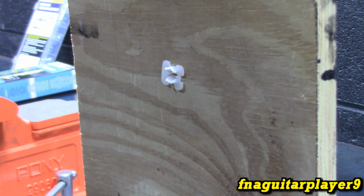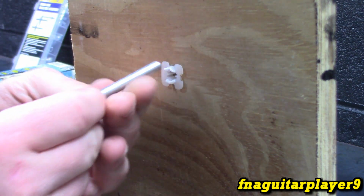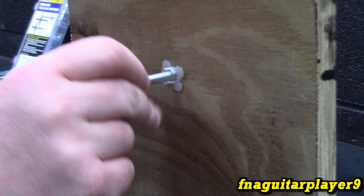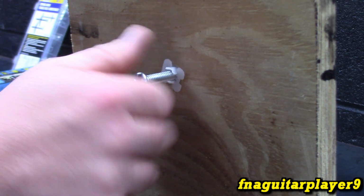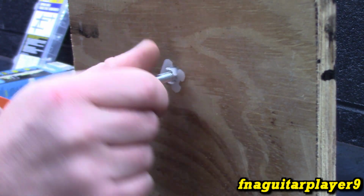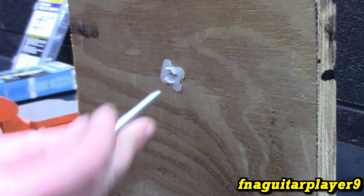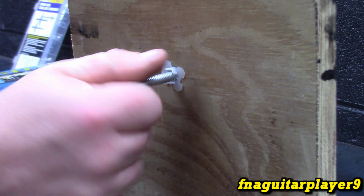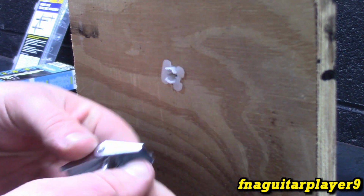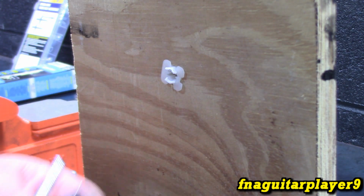Okay, so that's the top anchor installed. Now, this will stay in the wall forever now. So when you put this in, this is the advantage with this type. Once you put something in here, and you tighten it up, you can actually remove it later, and this piece will stay in the wall. So you can come back and put it back in again. So with the older style like this, once you take that loose, once that's expanded, this is just going to fall down in the wall, as you'll see here in just a minute.